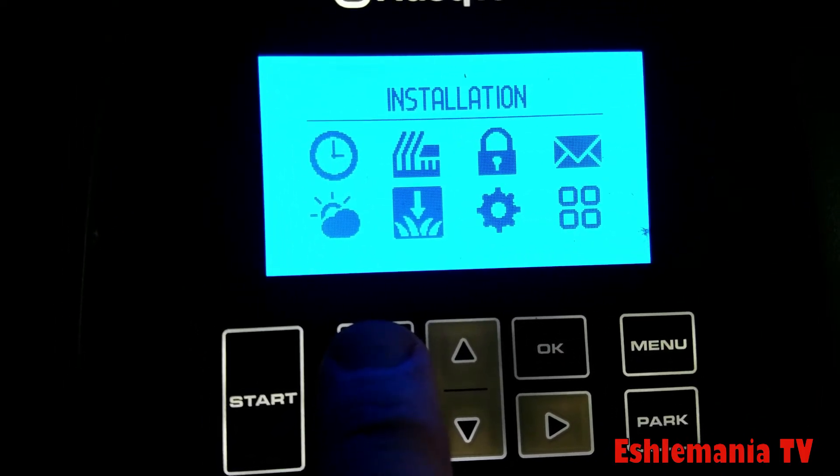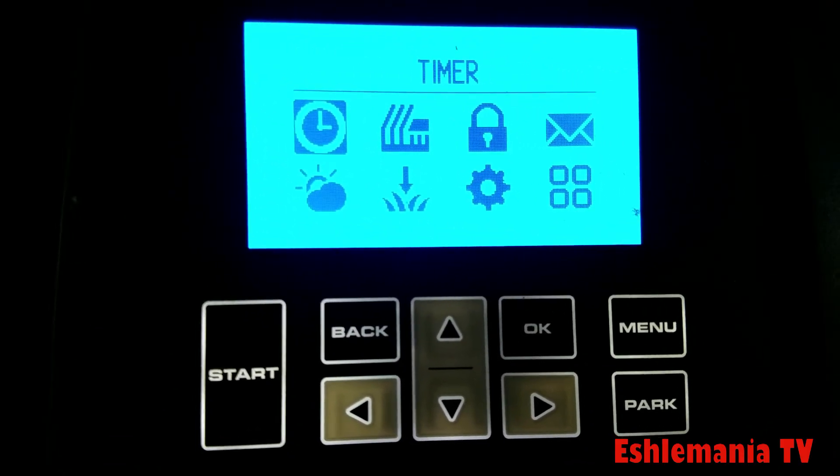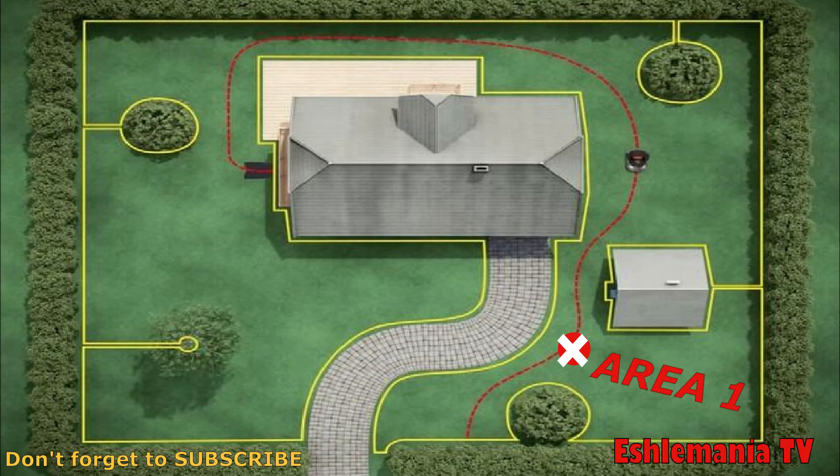That's how you do it on the mower — it sounds complicated in the manual because they use 'x' as a variable a lot, but it's straightforward. On our drawing, we have an auto mower with one guide wire and a perimeter wire — let's say this is a 315x where you can only use one guide wire. You'd lay it out using that guide wire to get through a narrow passageway between your shed and your house. Anywhere along that guide wire can be Area One — the mower comes out from the charging station a set distance, the blades turn on, and it starts mowing.